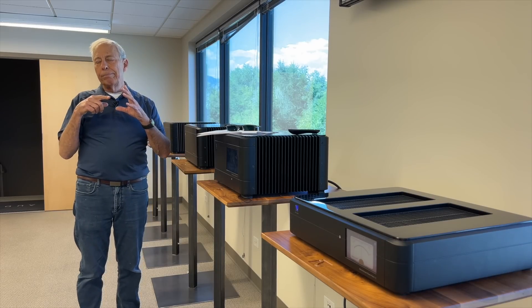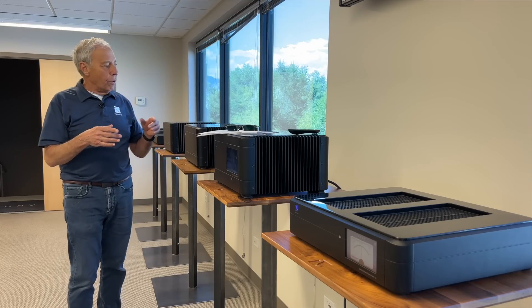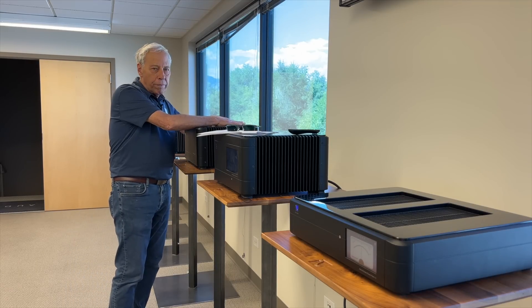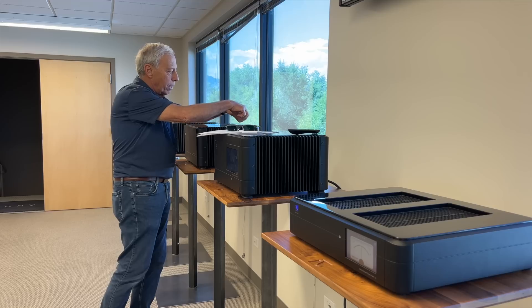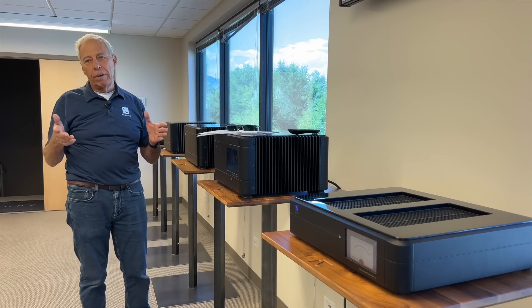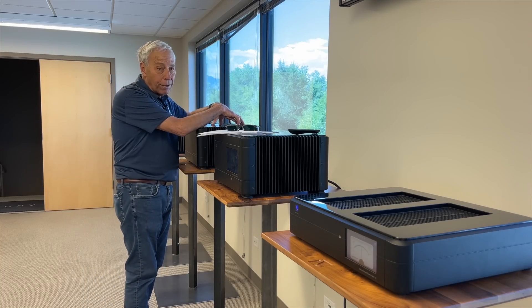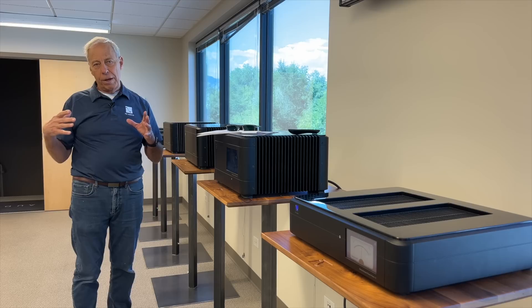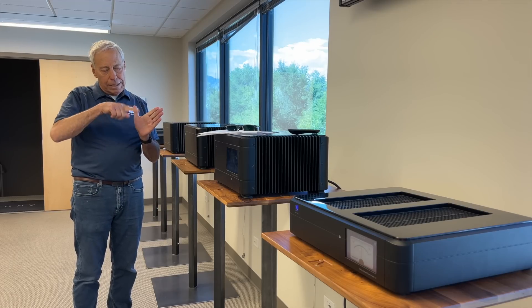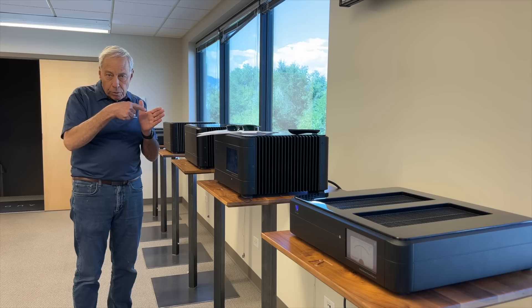Think about a coil where each winding goes to a different voltage. So when you order one of these, we have to know where it's going. If it's going to Europe, we take the windings that match your country and set it up inside so that when you plug it in, it works perfectly. If you were to take that amplifier to Japan, we'd have to open it up and rewire it to work there. But it's the same transformer, the same parts — just different wiring.